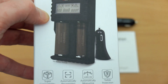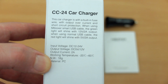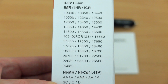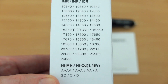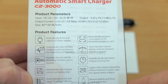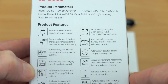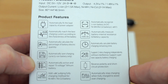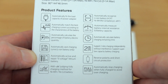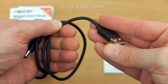On the side you can see there's an included car charger. This side lists all of the battery types it takes - 4.2V for the 3.7V lithium cells, and nickel metal hydride up to D size, which not all chargers can take. On the back there's a more detailed look at features: overcharge protection, capacity counting, voltage activation for zero-volt batteries, and Delta V termination for nickel metal hydride and nickel cadmium cells.